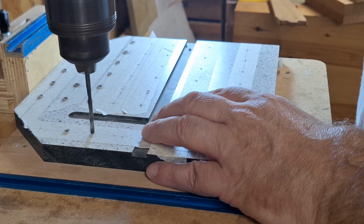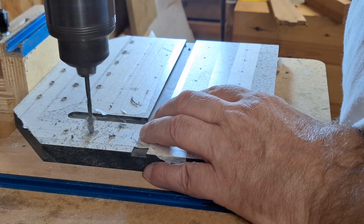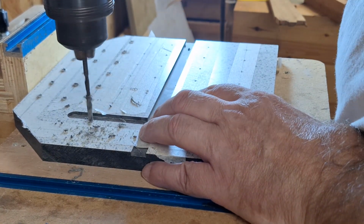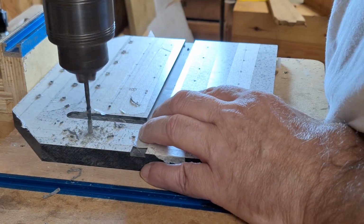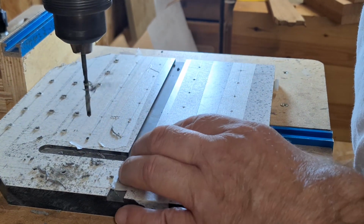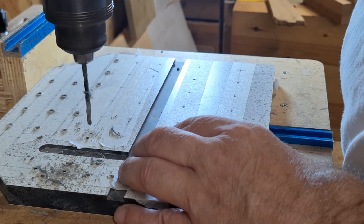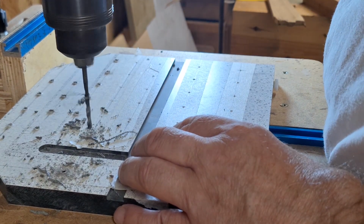The front face has an array of holes which allows me to attach sacrificial supports or mounting blocks for toggle clamps, etc. Below the saw line, I make sure only to use brass screws. I once accidentally ran my jig into my blade and it found a steel screw. That was not a happy day. It cost me a new blade.